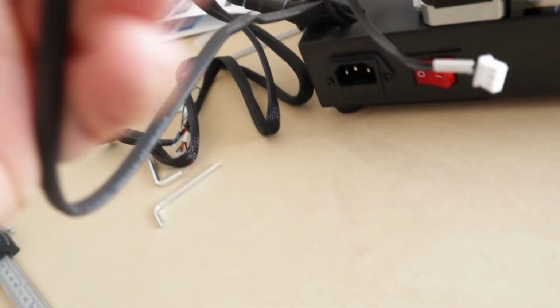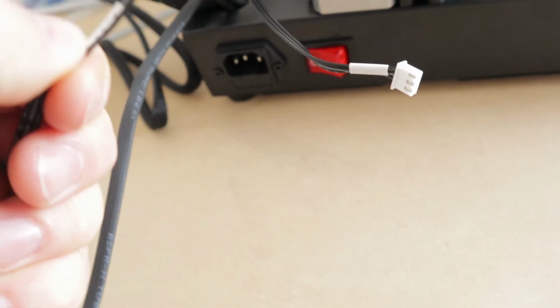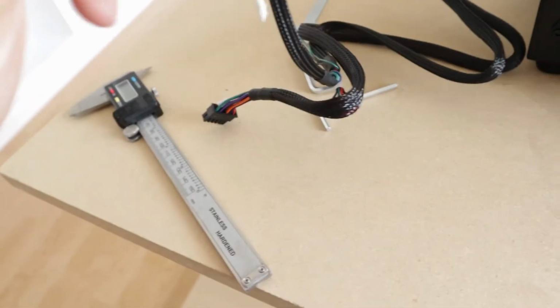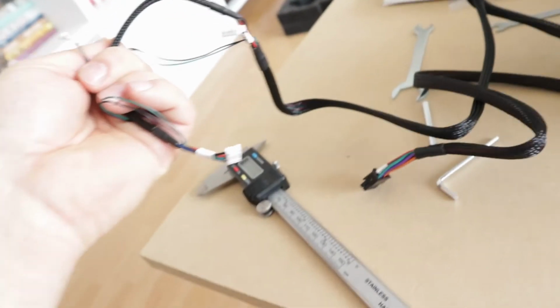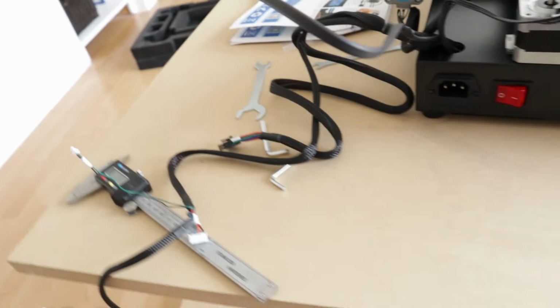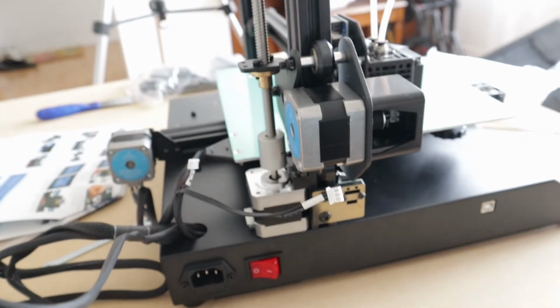Okay, so it looks like each wire here you've got XM, that'll be for the motor, and XES. Sorry, you can't see that, can you? Anyhow, the M is for the motor, the ES is for your end stop. And then you got extruder 1 and E1. So you've got your 2 extruder motor wires and your 2 filament runout sensors there, so make sure that you set each one to the right one. And I'm assuming your y-axis comes already plugged in, but it doesn't hurt to make sure everything's already plugged in. So let's go ahead and wire it up.